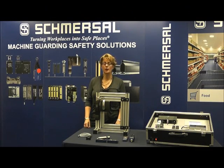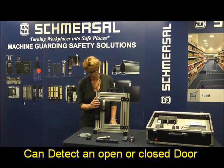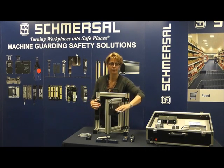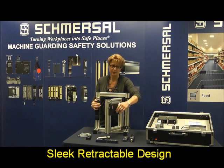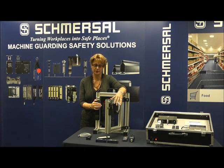The Pulse Echo sensors and interlocks are used for monitoring movable safety guards. When the guard is open, the machine is stopped. With the AZ200 interlock or the AZM200 solenoid interlock, the mechanical design of the mating actuator target retracts back into the door handle assembly, ensuring the actuator itself does not get damaged or pose a danger. The actuator unit also allows for an additional door detection sensor, which is used for safety guard monitoring.